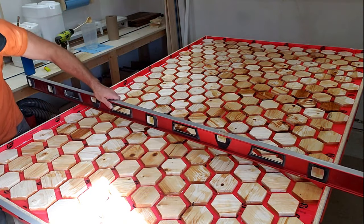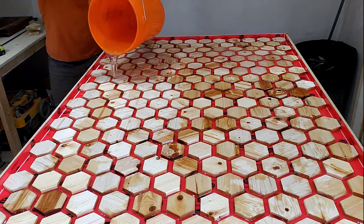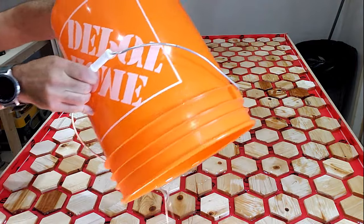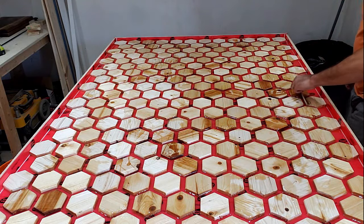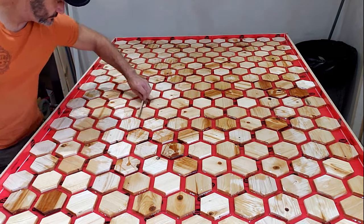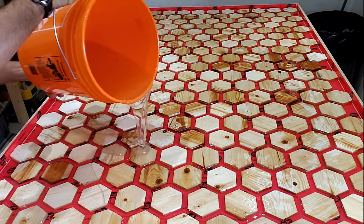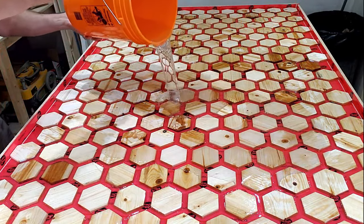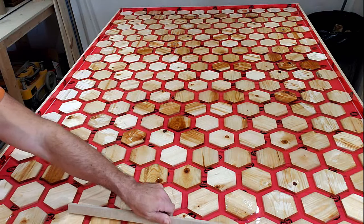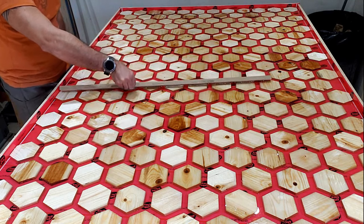After about a day I let it sit to make sure it didn't have any leaks, and once I was happy I came back and made sure everything was still level and nothing had shifted. Once I was happy nothing moved, I decided to move on with the next pour. I did this in three pours instead of filling it right to the top at once. Unlike a river table, the epoxy doesn't spread down the middle — you have to really work it through all the nooks and crannies of all the different hexagons. It took a while, and sometimes since the table was fully level a lot of it just stayed on top. I needed the epoxy to be in the honeycomb pattern of all the hexagons, so I took a good while to spread it into the middle and all into the pattern before going on with the next pour.